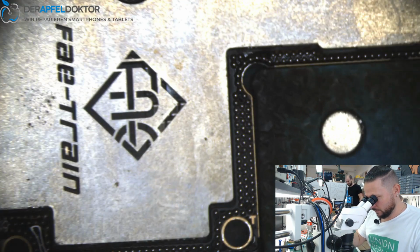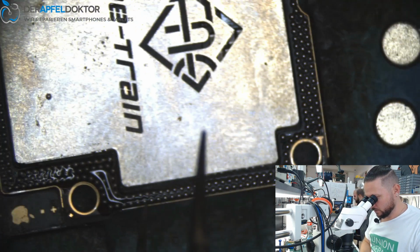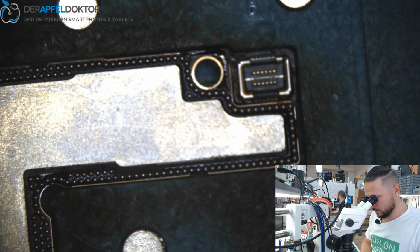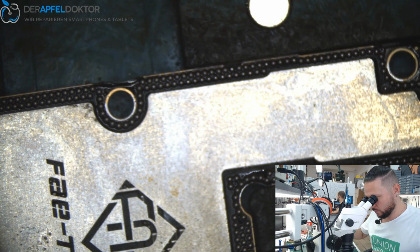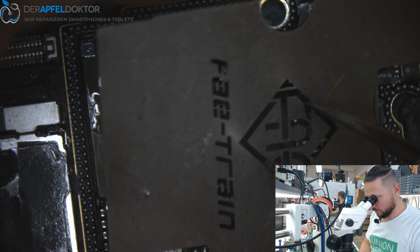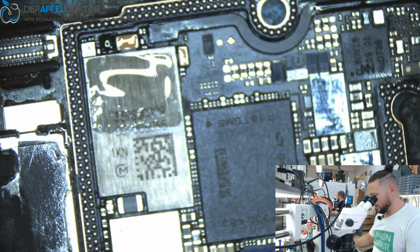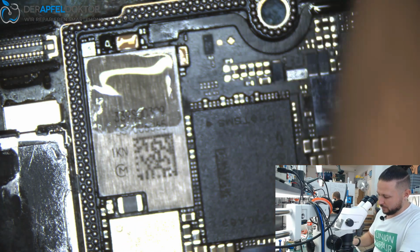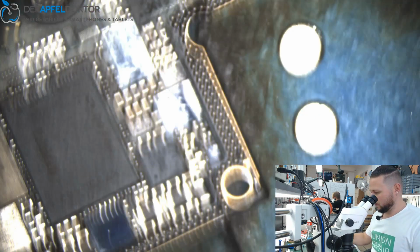Wait a short time and you see this 183 cools down much faster, because the melting point is much higher than a low melt solder. So you save time on cooling down. Not on melting, on getting back to the form, okay?